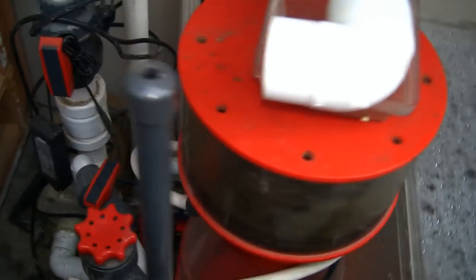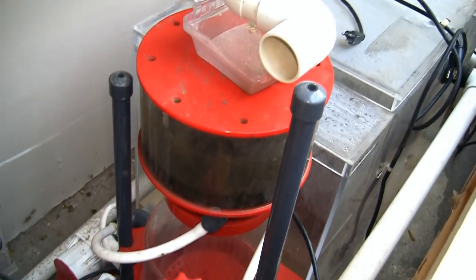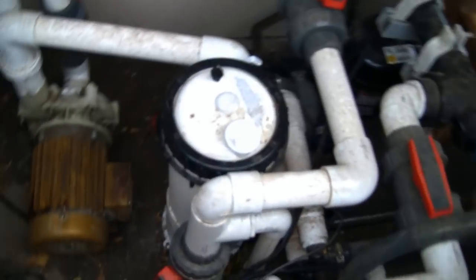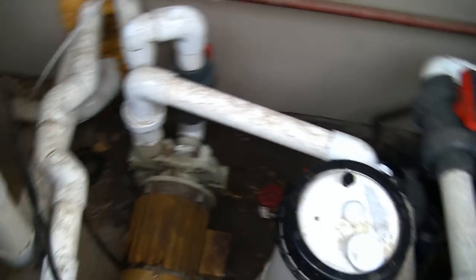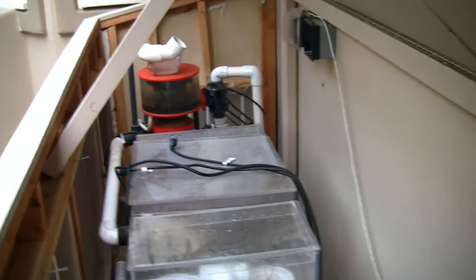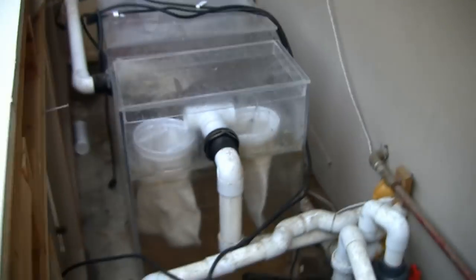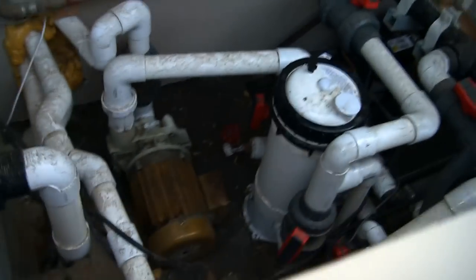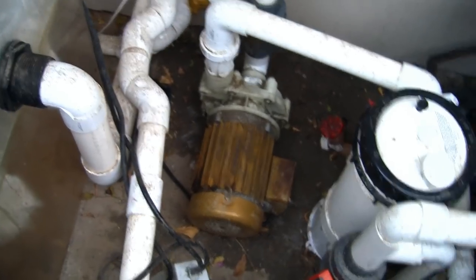The filter system has been drained of its water. I've got some new filter socks in there. I should take the collection cup off the protein skimmer and get it cleaned out. This is the refrigeration unit over here. There is no pleated cartridge inside that canister. A large hammerhead gold pump, and again the sump with the protein skimmer, and I believe its other main filter pump — also a hammerhead gold — is down here. Those pumps are supposed to do like 5,600 gallons an hour, but the plumbing's been done in a manner that they're quite restricted.